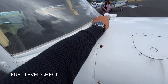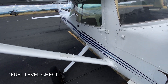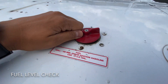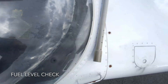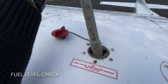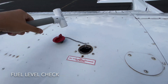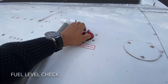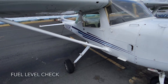Now we're going to go over to the other fuel tank. Remember: hold on first with your hand, right foot close to the engine, left foot on the strut. Open it up and check the fuel again using the fuel stick — essentially the same procedure as the other side. As much as possible, both tanks should be equal in terms of the amount of fuel, as this helps with weight and balance. Make sure the fuel cap is straight when you close it.